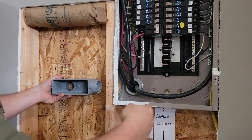Pause the video, leave me a comment below. Let me know if you found the problem. Do you know where it's at? And if you're ready, I'll reveal where the problem is, right there. Why is that a problem? That's not a Romex connector. This is a Romex connector. See how this clamps down on it? That clamps down from that side. It's closed off here. This is not closed off here.